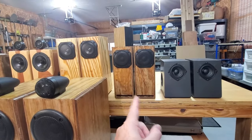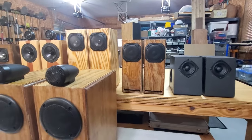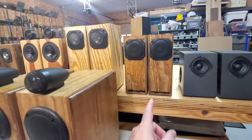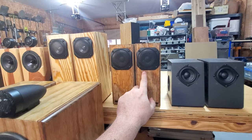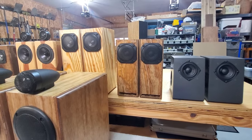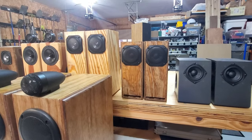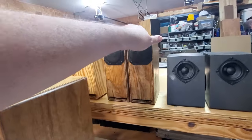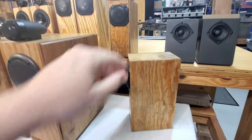The main issue that I experienced, again, with small drivers is the audio Doppler effect. And obviously, it's been around for a while, from my little bit of online research. When these things were playing heavy bass music, the excursion would affect the mid-range and treble pretty noticeably. So you get this strong little warble kind of sound in your treble, and it almost sounds like a chipmunk when somebody is singing. Other than that, like I said, the bass response out of something that's about the size of a cigar box is pretty crazy, what these things were pumping out.